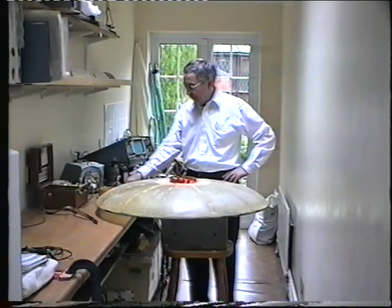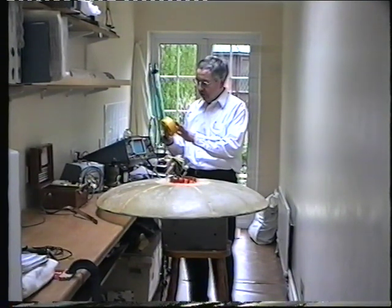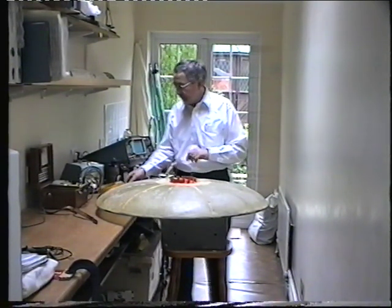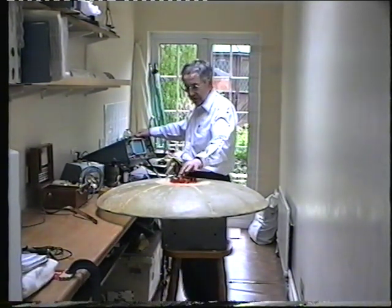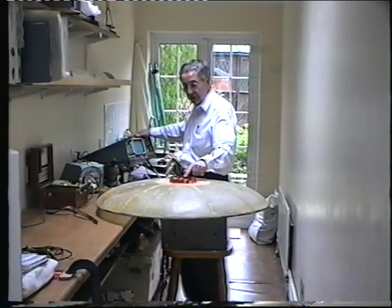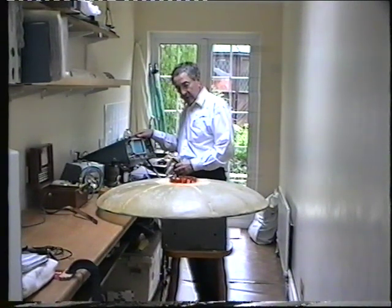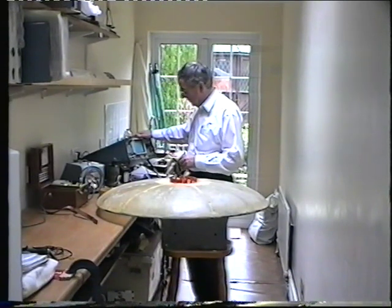What I have is an airflow meter — the type you'd find used in air conditioning systems — which will typically measure airflows from about 50 feet per minute up to about 5,000 feet per minute. I also have an oscilloscope connected to a small Hall effect sensor near the motor, with a small screw that registers a pulse every time it passes the sensor, so I can measure speed fairly accurately. It's not the best method, but it's a simple and visual method.